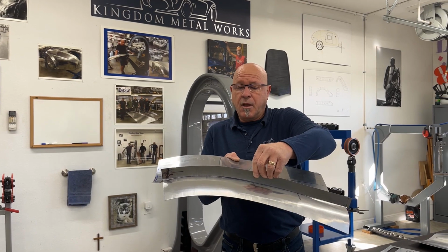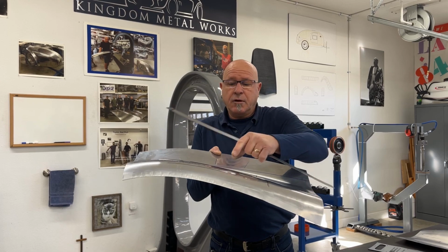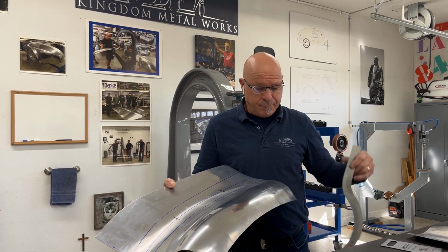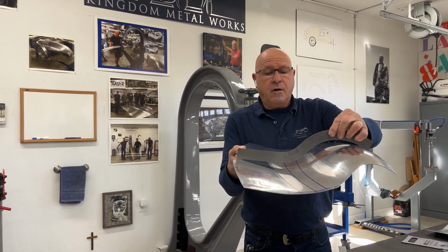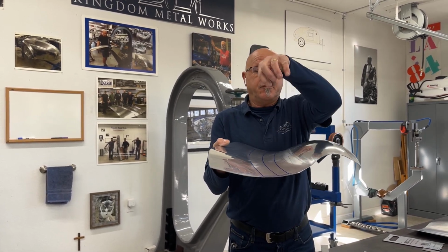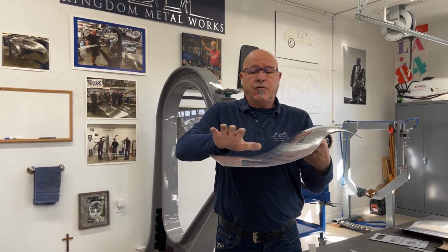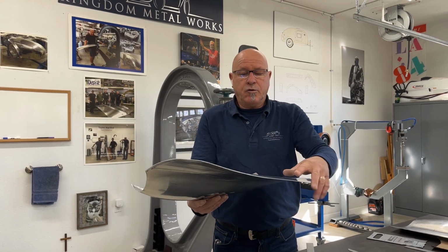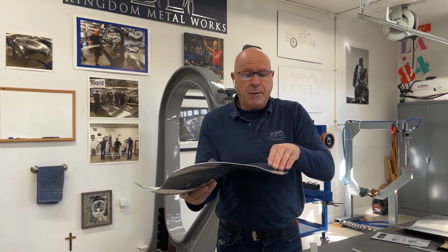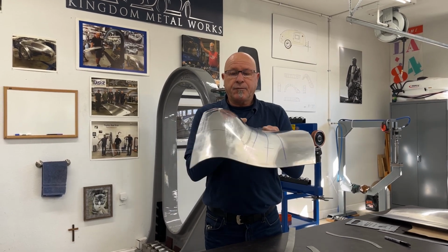Coming in and through. I can see right in this area, a little light line, a little gap. I'm needing to put a little bit more bend in here to bring this up. And this profile says exactly the same. So then this one wants me to throw this panel down by bringing this panel part up. This will come up, this will drop down, and then I need to transfer this over just a hair more, which will be my reverse curve. My reverse curve, I will then change wheel into a number 5 to give me that more detailed shape, and that'll be on the next video.